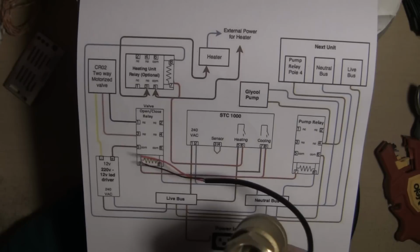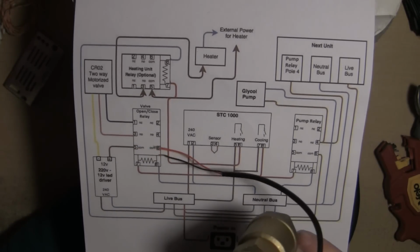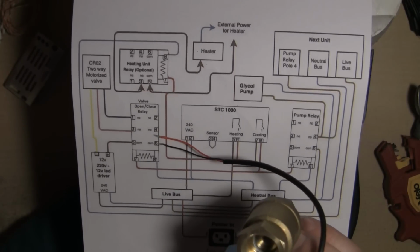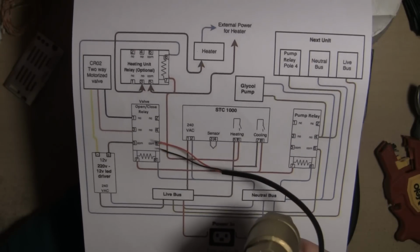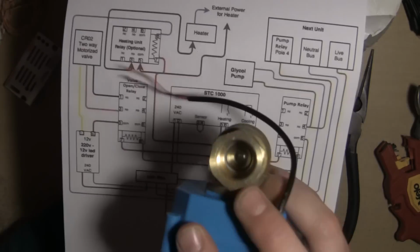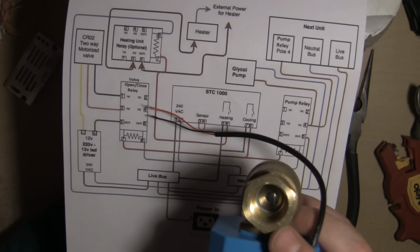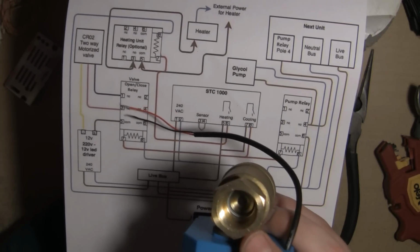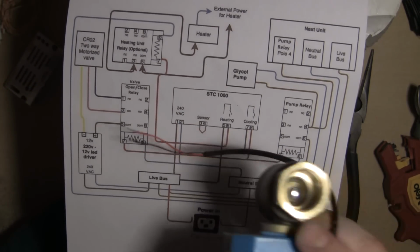So you'll have your DC positive, negative on 5 and 6 respectively, and then let's say you've got your positive on pin 6. In order to reverse the polarity, on the normally closed side you'll have the positive from the valve, the red cable, and you will also have the red cable on pin 3, and then the black on 1 and the black on 4, and then just tie them up together this end.